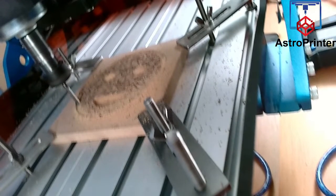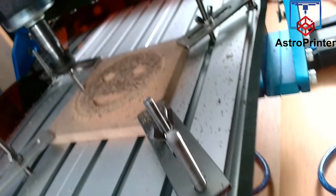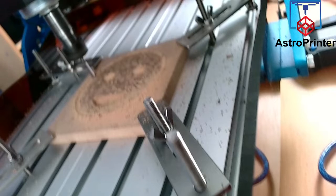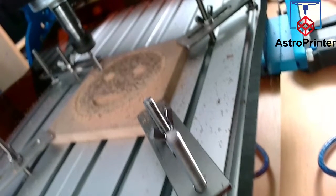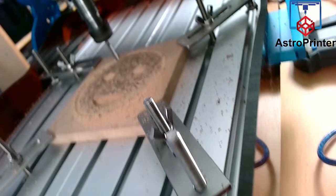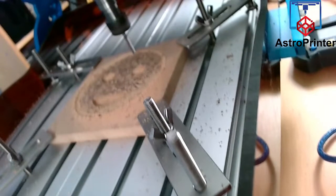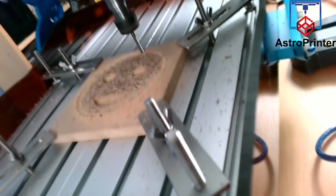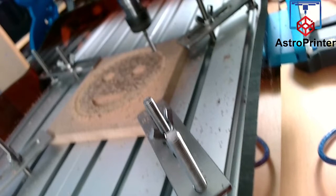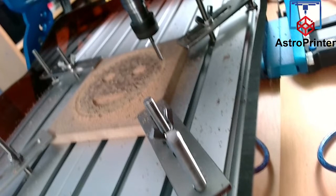So this is working. There's a connector on the back. Actually, I'll show you now if you want. There's a connector on the back that's actually wired incorrectly for the connector type. The wiring was 90 degrees off what it should have been aligned to. And they're designed to lock together, so when you put them together naturally, the wires were not right. But when I separated them and checked the wires and saw the way they were, I turned it 90 degrees and plugged it in so the wires aligned color to color, and that solved the issue. So it's a QA thing, not a major issue, but they need to address it.